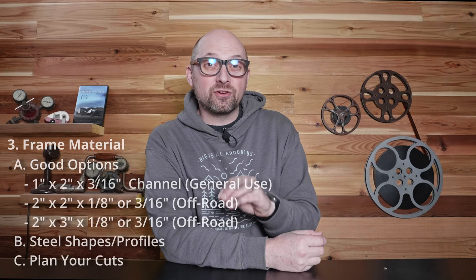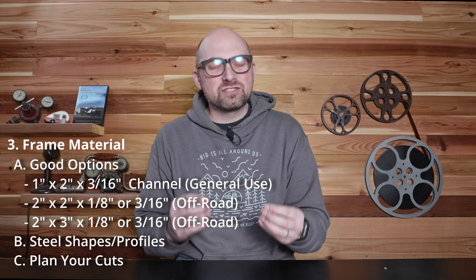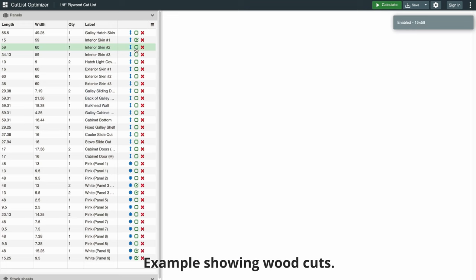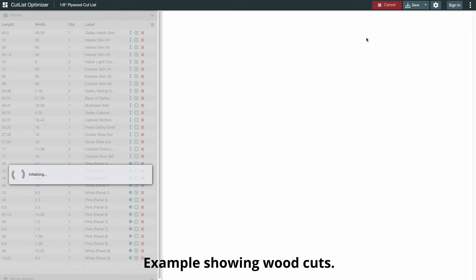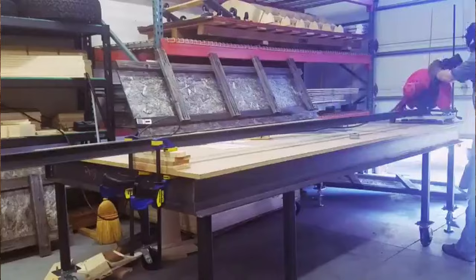The last part of your steel shapes is to plan your cuts efficiently. I love a free online tool called cutlistoptimizer.com — I'll put a link below. You put in all of your steel shapes and lengths, account for blade thickness, enter all the parts you need for that shape, hit go, and cutlist optimizer lays them all out in the most efficient way with the least amount of waste. Then you have a cutlist and a picture of it. I believe cutlist will only let you run about 10 simulated cuts a day, but if you're patient, you'll get down to exactly what you need.